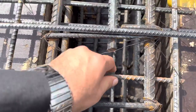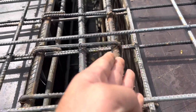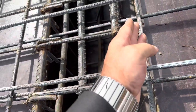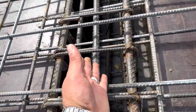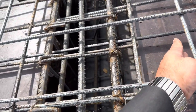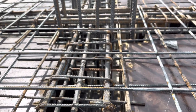This is inside the beam — the slab reinforcement is inside the beam. If they extend here, that will be better. First of all, this is not the place to provide lapping. If they do provide it, it should extend a minimum of six inches on each side, but they didn't do that.